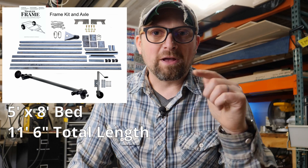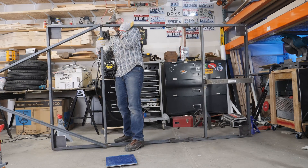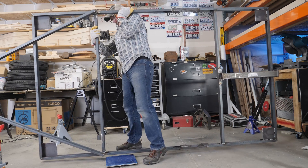You can find more about the kit down below, but you can also do this with any metal you have. The frame we're welding today is 1-inch by 2-inch by 3/16-inch channel, but the principles can also be applied to a tube-style frame. There are multiple ways of doing this, so feel free to drop input below. At the end of this video I'm going to weigh the trailer frame so we'll know exactly how much it weighs, since weight is very important to teardrop trailer builders.